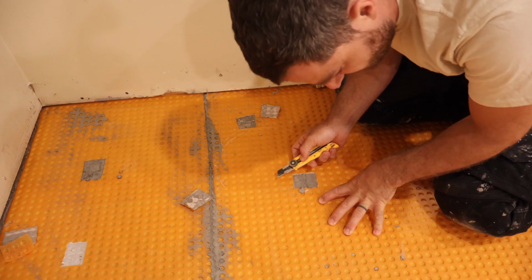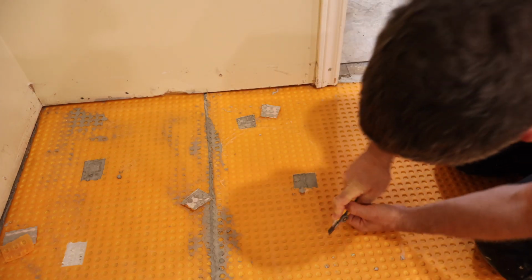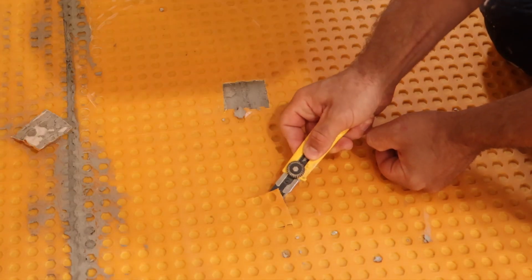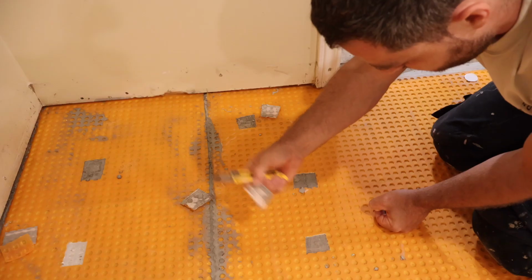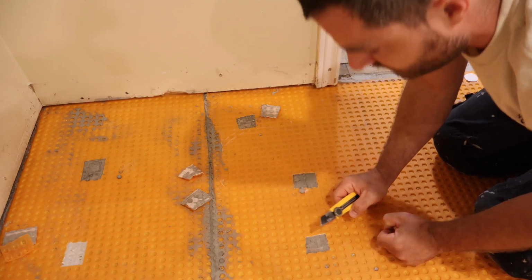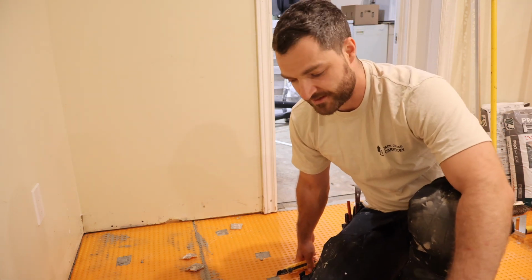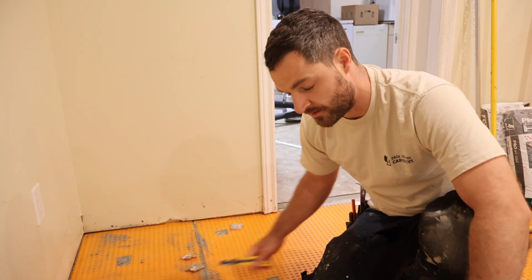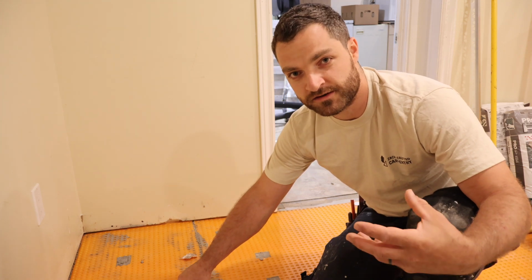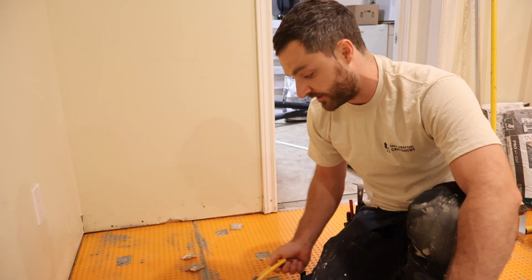It was kind of dry. I'm gonna test somewhere else though. Yeah, that's barely adhered. So I think what I can determine from that experiment is that it does need to be primed, and you just have to have the compatible thin set with that primer you use. Just keep it within the same brand.